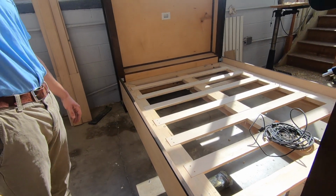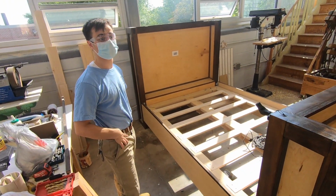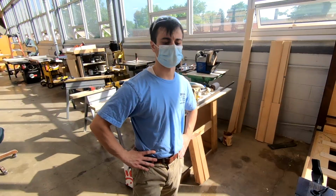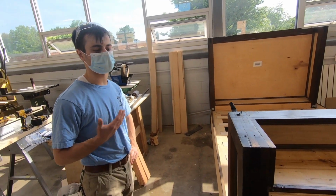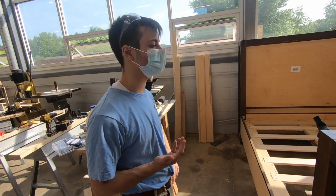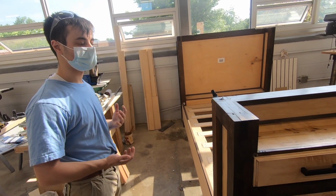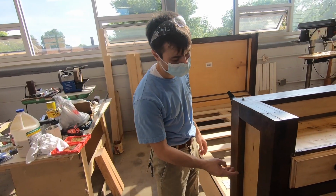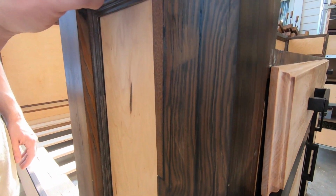So we were lucky enough to work at the dorm renovation, and when we cut a beam out, we were allowed to claim it. Some of the challenges of working with reclaimed wood is that the wood's really not perfect. Especially from these beams at Stell, there were a lot of scabs and stuff installed over the years, so you don't get a perfect cut. When I milled these, there were some notches, so I had to take strips and put them right in.